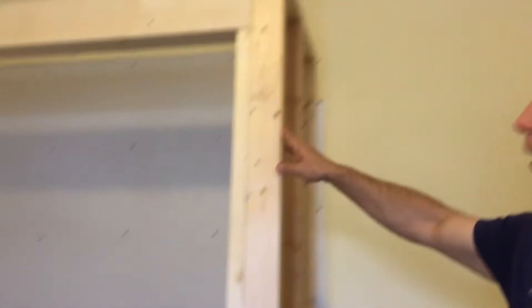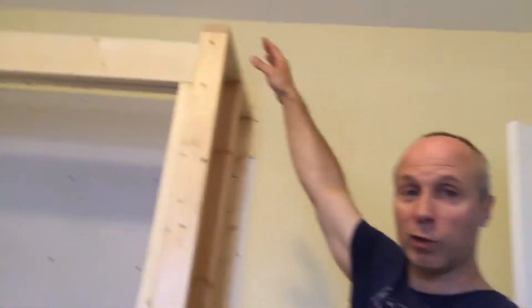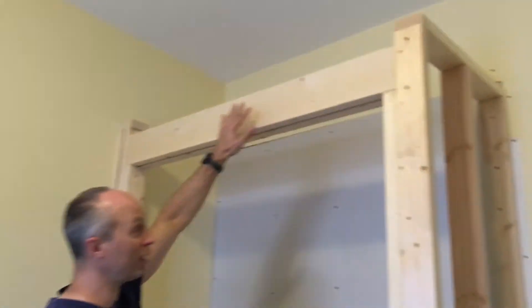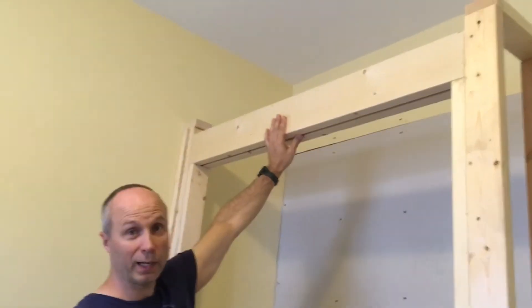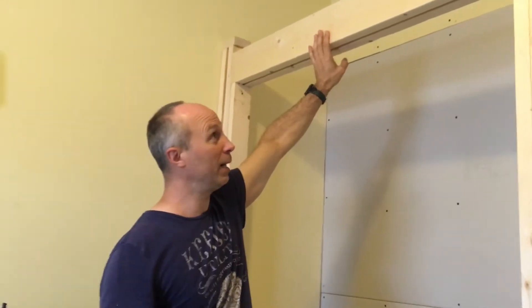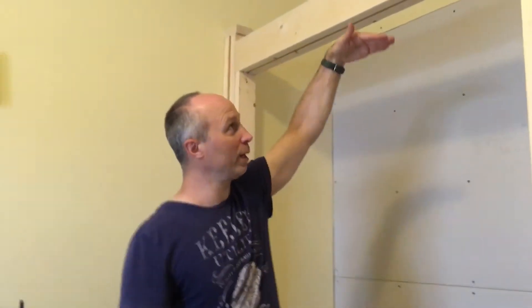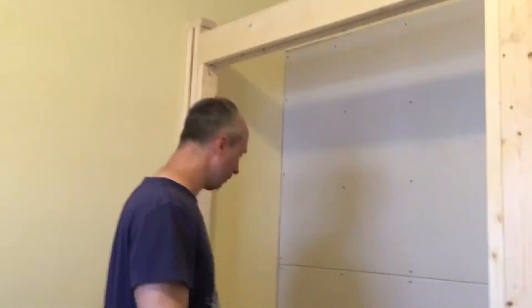In this case, this is not a typical installation because normally this applies where studs go right to the roof supporting everything. But here it's not — even though I'm going to frame the very top and drywall it on, there isn't going to be a weight on it, so this is more than enough. In a case of this length, I could have used a two by four as long as they're put vertically. You never want to put them horizontally or they could warp or bend, and then you have problems.